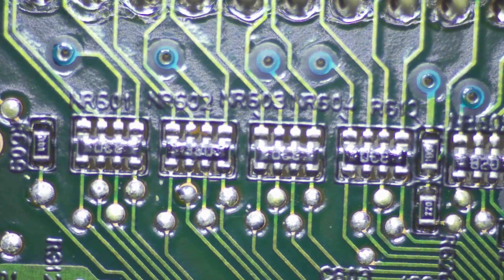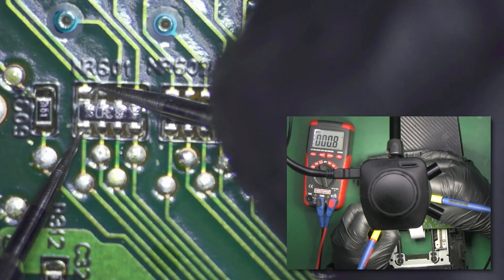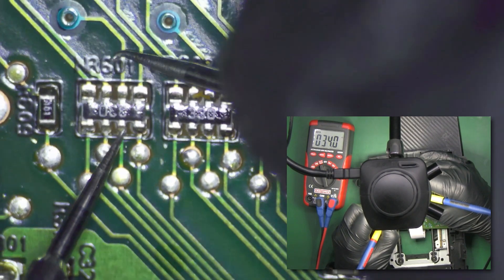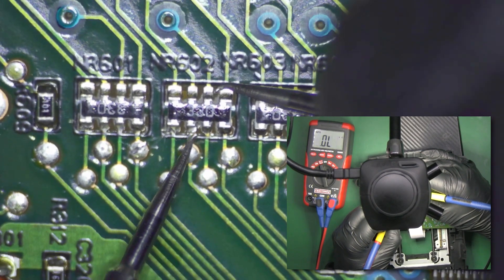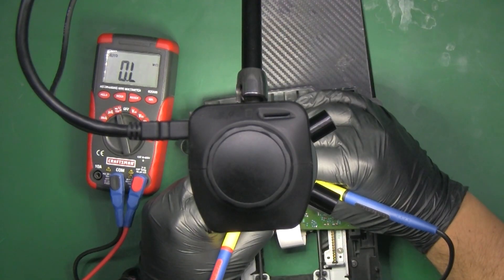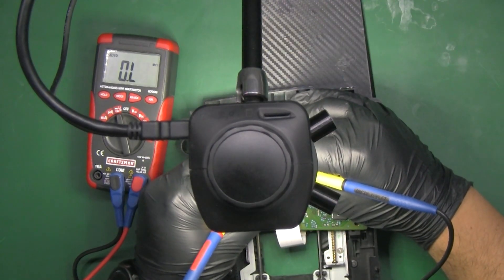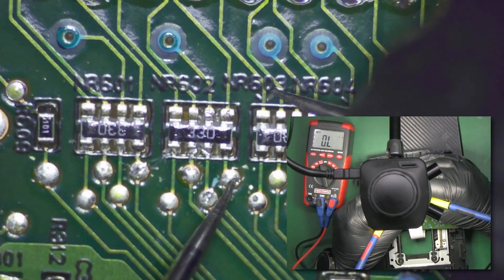We have to take this apart. If I remember correctly these are supposed to be 33 ohms and this last one over here is supposed to be 82. Let's double check — yep, 33, correct. This one is in spec. I am going to continue checking these until I find one that has failed. Looks like we found one that has failed — this one's actually open according to my multimeter, and I'm applying a tremendous amount of pressure on it and it still shows open. So this guy has probably failed and that means we're going to have to replace this entire resistor array.